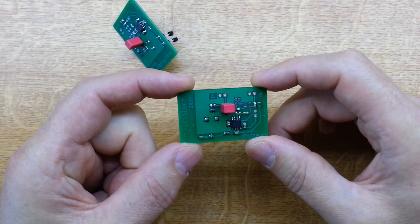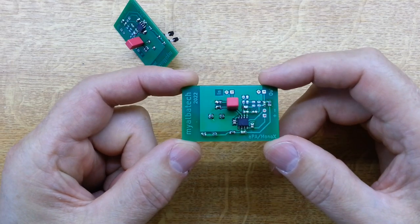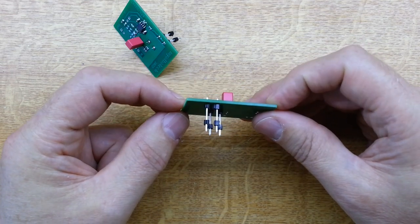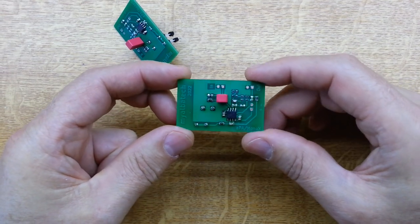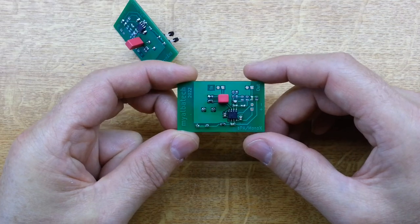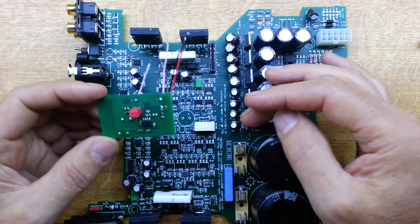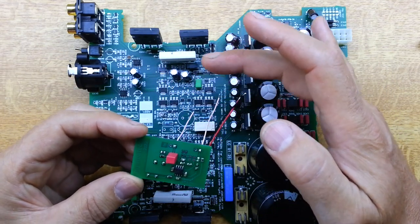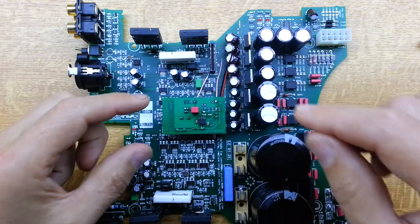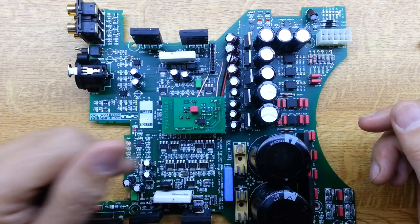Here I've got a couple of assembled boards — I'm going to upgrade a pair of APA 7.5s. The complete board has headers on the underside so they can solder directly onto the main board of the amplifier. I'm going to install these now and do some testing on the audio side. With the board fully loaded up, I've got wire leads for power and then the signal in and signal back out to the board. It fits in exactly as expected — we verified that with the Mono X board previously. I'll go ahead and wire this in, then start making measurements.